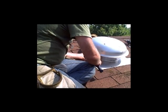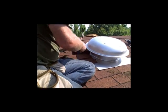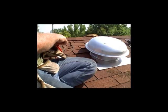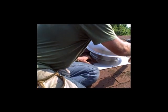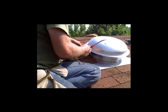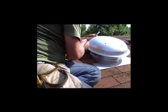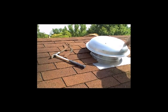I'll be putting some silicone caulk on the nail heads and underneath the shingles that I've separated, because especially on older roofs, that tar adhesive used to hold shingles down in the wind — once it's separated — may not seal again. So I'll use a little bit of silicone under the shingles, not so much for sealing, because it doesn't really need to be sealed, but it does need to not blow off. The great thing about silicone is it just stays soft and sticks really well to that aluminum and those nail heads.